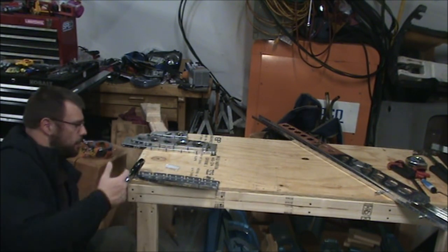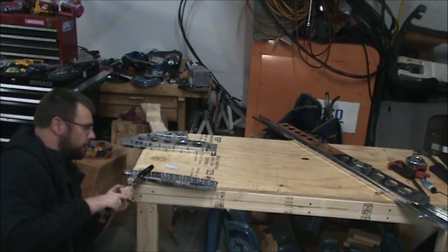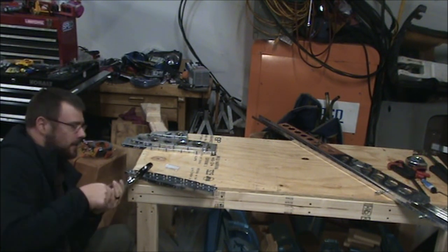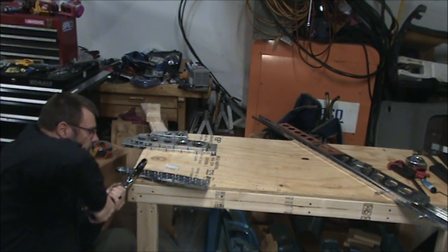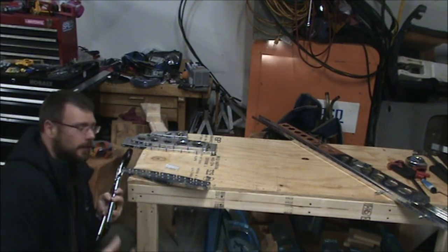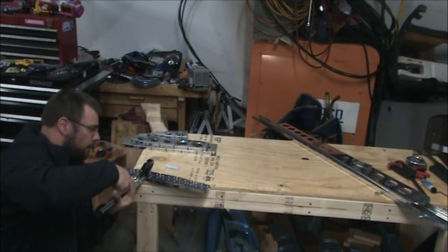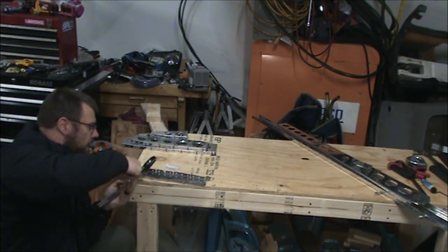I guess they make special dies that are supposed to be for the interior structure. I really haven't seen any aircraft kits call those out as needed. And after dimpling the one rib and placing it in here, it doesn't appear like a special die is needed either. They seem to mesh together really well using the same die on the skins and the interior structure. Of course, feel free to comment below and tell me I'm wrong.